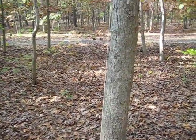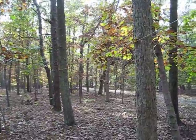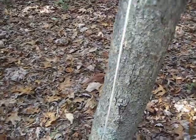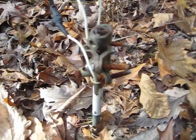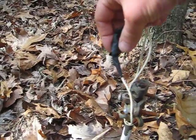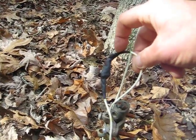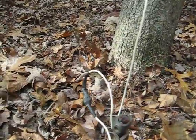You can see the beverage comes in from way down there, 500 feet away, comes to a tree through an insulator, and down vertically here to a ground rod. Before the wire attaches to the ground rod, it passes through a resistor, which I have taped up here. I'm not going to untape it to show you — just a wire through a resistor.